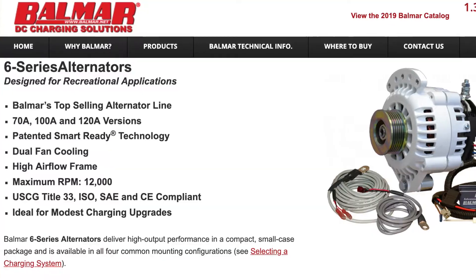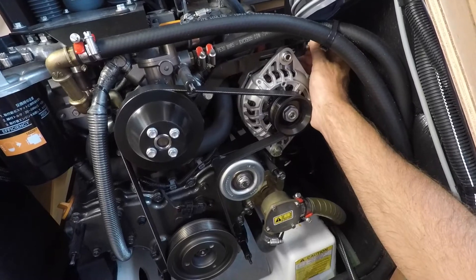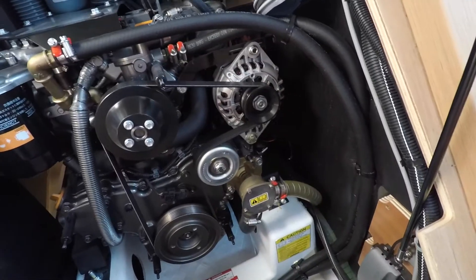The typical way to accomplish this is to buy a third-party alternator — Balmar makes plenty of these. That's what I'd done on a previous boat: a high-output Balmar alternator combined with an external regulator like the ARS-5. However, Balmar has tested this stock Yanmar alternator and found it's rugged enough to handle the extra work a multi-stage regulator puts on it. Many stock alternators aren't robust enough, which is why you'd have to replace the whole unit — but on most recent Yanmar engines, you can use this Smart Ready Retrofit Kit.